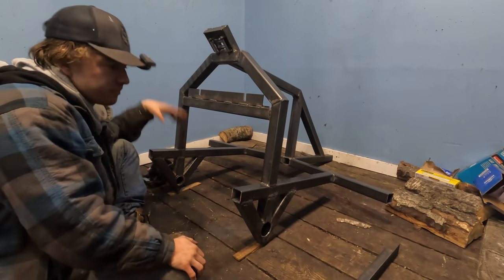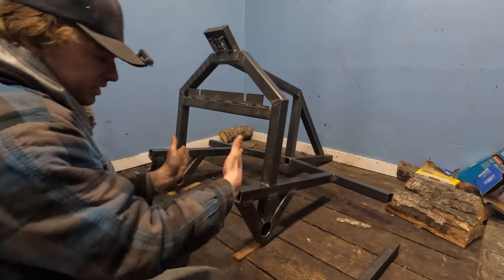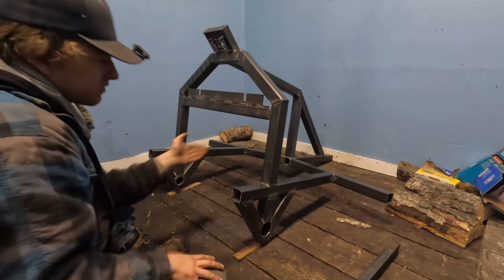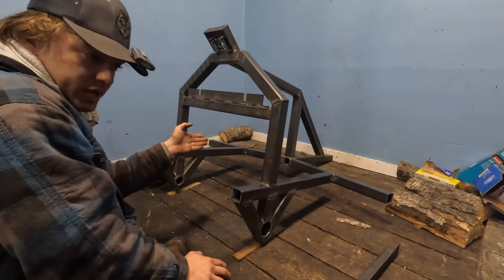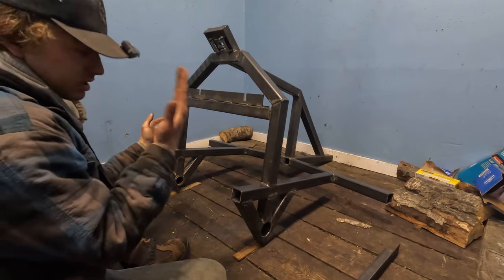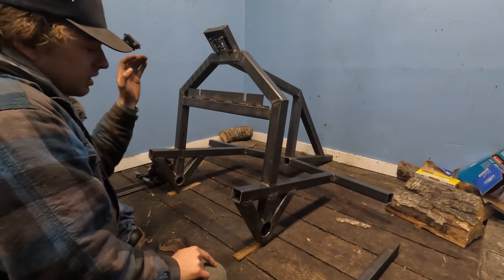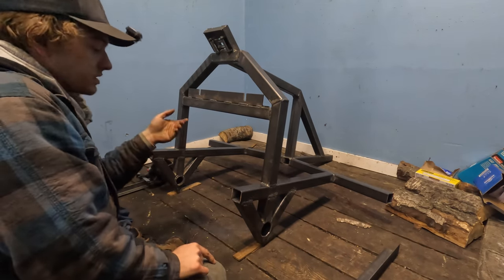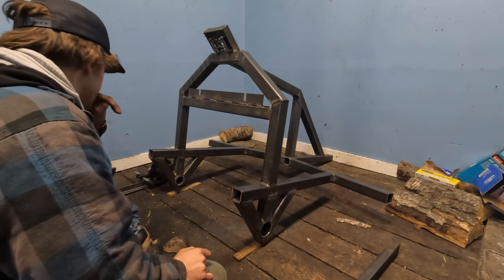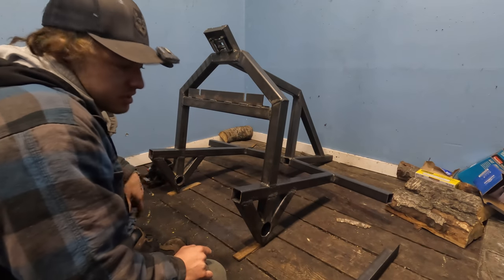And then also them to be in line with what's pulling it. So if this is what's pulling it, you don't want the tires in line but going out that way, because you're gonna wear shit out that way too. So we have to line it up so it's perfectly that way as well. Okay, so it's getting tricky. Also, we have to level the hubs so they're level all before we put one tack down. So that gets a little bit tricky, of course. And then while we weld, we gotta make sure it doesn't move and that it stays true. So it really is a tricky son of a gun. But I figured out how I'm gonna do it, and it just becomes finicky.